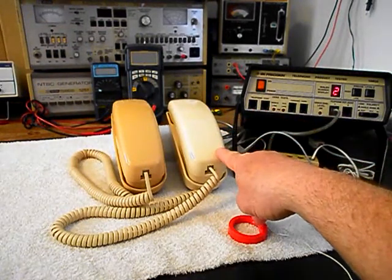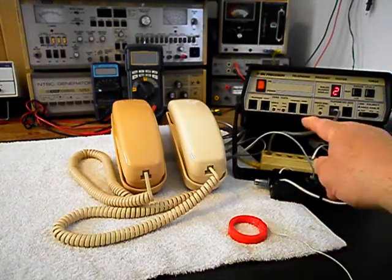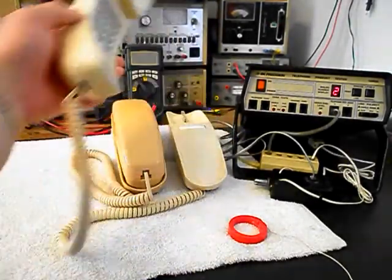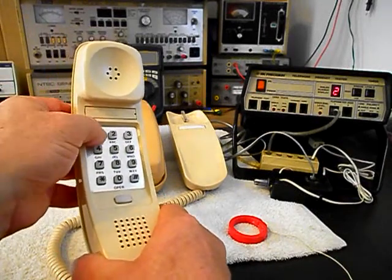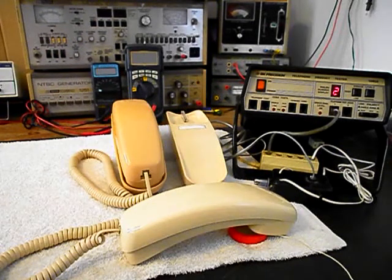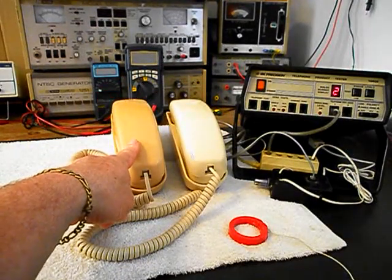Now that we know that this unit is ringing in on a ring cycle, we're dialing out, we have transmit and receive. We can push this button on the switch box — that gives us a line out, totally takes the analyzer out of the situation — and we can call a time and temp number. Go ahead and give you some dial tone and we'll make that call. The recorded message confirms: today is Monday, May 14th, the current time 5:10 p.m., and the temperature 86 degrees. We'll go ahead and hang up our handset. We're going to go ahead and switch to the second phone, so we'll be right back.